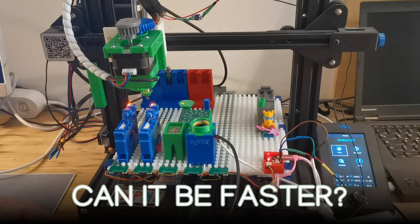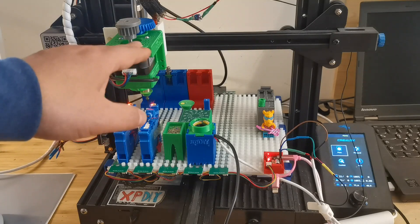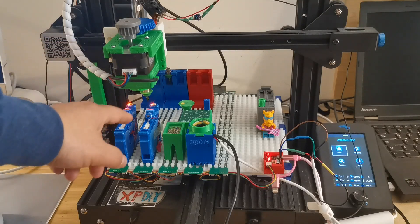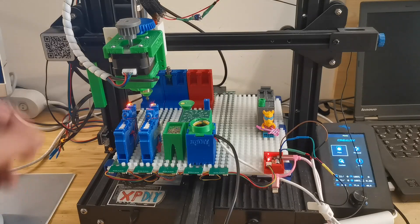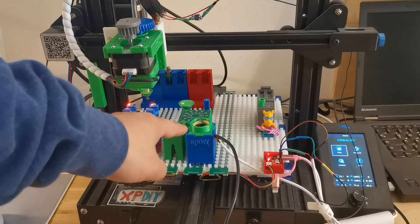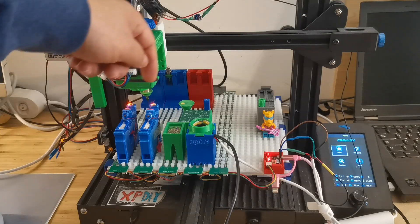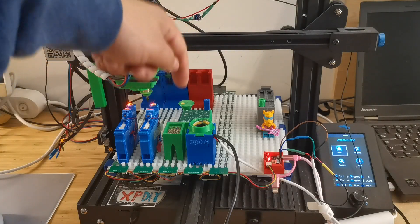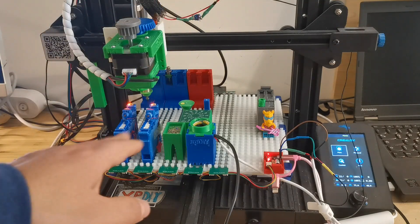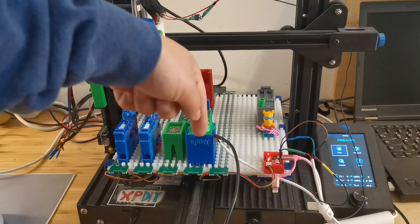So I looked into the placement. Typically you can see the nozzle head needs to go to the feeder and then use the top camera to look at the hole to identify the position. This takes some time, but then it goes down to pick up the component, then goes to the bottom camera. What I identified is that the bottom camera takes most time because it needs to move there, go down, identify, and go up — and this takes quite some time because the 3D printer cannot move up and down very fast.